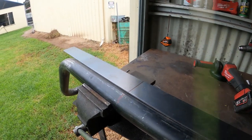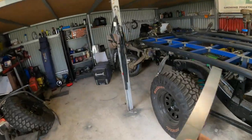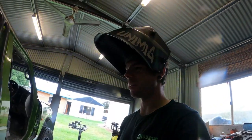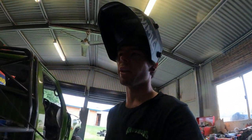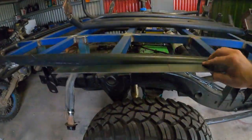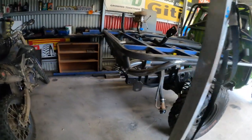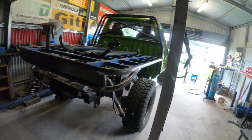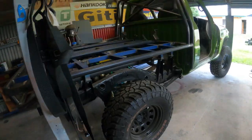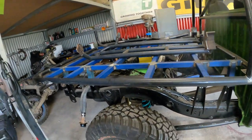I'm going to weld this piece to the top flush so that I can grind this edge down and it'll look even, and then I'm going to weld the flare flush to the tray so I can grind it down and that'll look even. That's not normally how I do it but I want this one to sit — normally I just completely cover the top of the flare and weld it underneath the tray, but I want this one to look really high, so I want it to be the same height as the rest of it and I'm going to have to cut out the right pieces for that. I'll tack this back piece in place and see what it looks like — I might end up pulling it off and putting it back on the other way yet, but we'll give this a go.